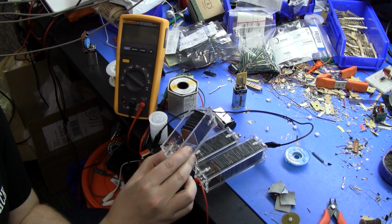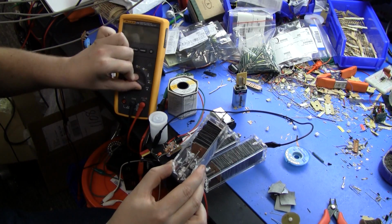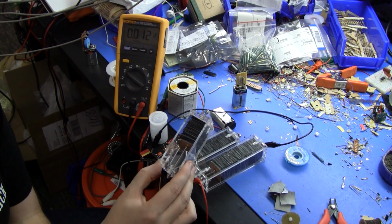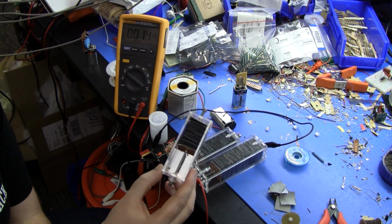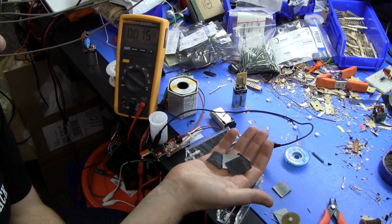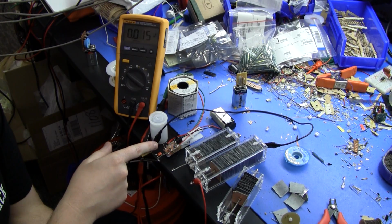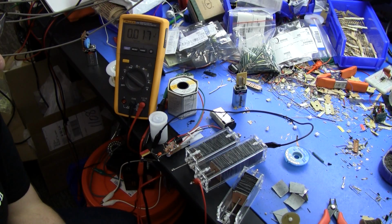And this one here is one that I'm building right now that I added ammonium chloride. Oops, voltmeter went to sleep. I added ammonium chloride to the chemistry of the manganese dioxide side, which increases the cell EMF quite dramatically. I've only made 88 cells in this one so far, and we'll measure that one in a second. You can see here I've got a whole bunch of different test pieces that I made up, and I used the high impedance voltmeter that's part of this charge division, or I guess it's not technically charge division, it's more like a voltage division electrometer, a constant charge electrometer.